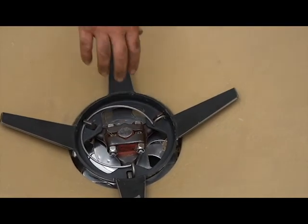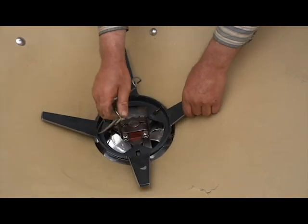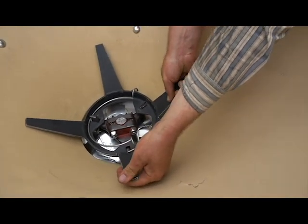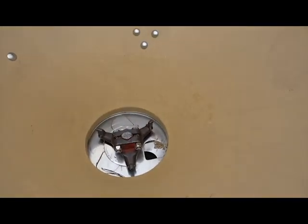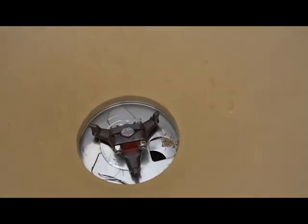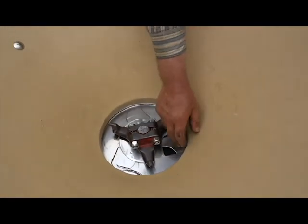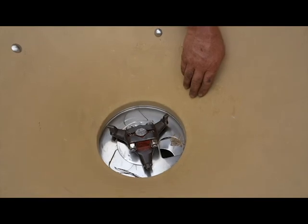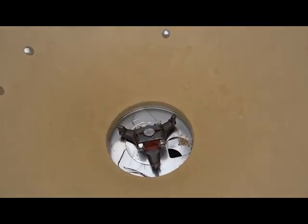Since we don't need the agitator, we'll go ahead and remove that. And you take that spring loose there and there. And you pull that up there, and you can take that out. Now that will leave this bottom arm, which will rock back and forth and create enough agitation to keep your hole clear from plugging up with sticks or a leaf or something like that. That should be all you need for agitating what we're planting today in the early wild rye.